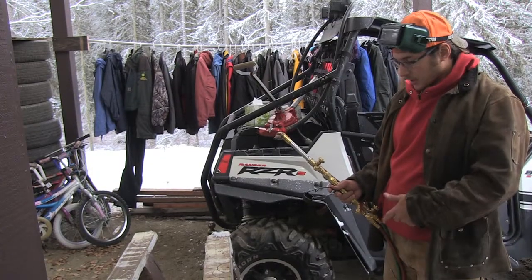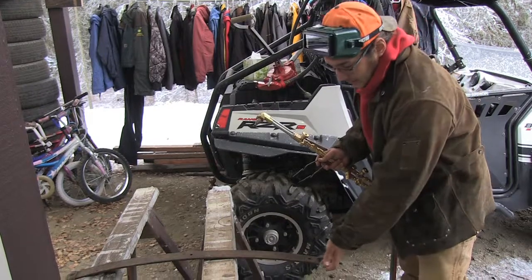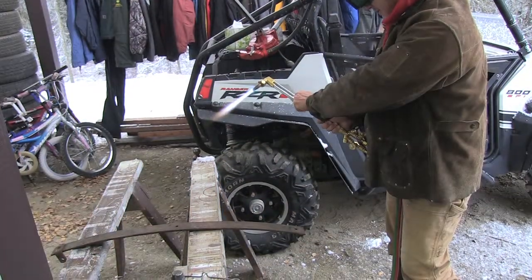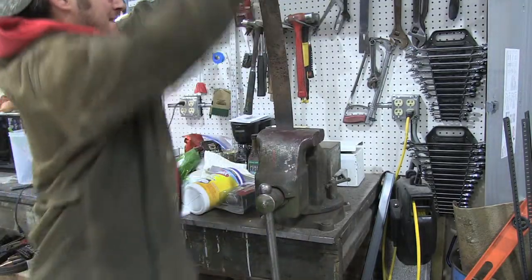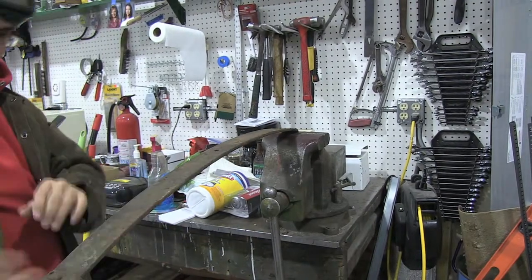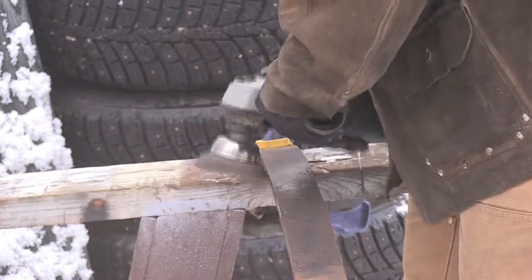I'm lighting the cutting torch with a neutral flame to heat the metal until it glows cherry red, making it easy to bend. Then I'll clamp it in the vise and bend it so the existing hole lines up to screw into a wooden frame. After bending, I'll quench it in snow, then wire-wheel all the rust off using a disc brush on an angle grinder.